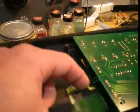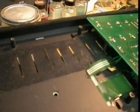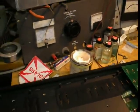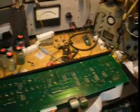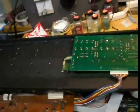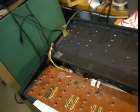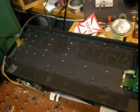I found a very low stress place and attached them there with that springy adhesive. So that should put that into a framework of being able to work indefinitely. Chroma Polaris has all kinds of software tweaks. You can set the velocity of each key, the velocity response. If you have clean contacts and you set that all up, they should work great.